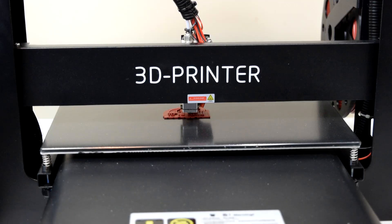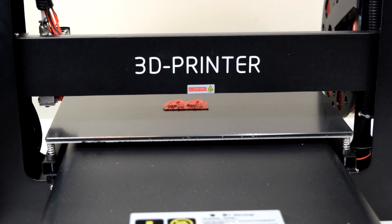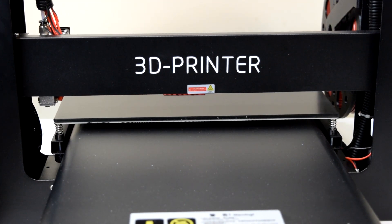I should point out that if you don't get a chance to restart your print before the bed cools down, there's a good chance it's not going to work out. Since parts come off the bed so easily when it's cold, there's no guarantee your prints are going to stick during a long power failure. But in my opinion, that's better than nothing.